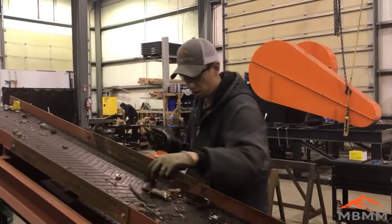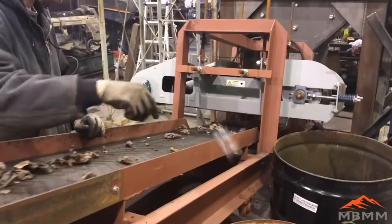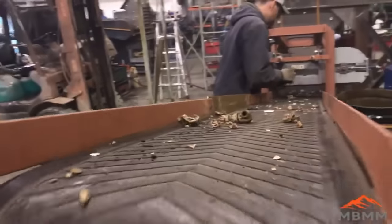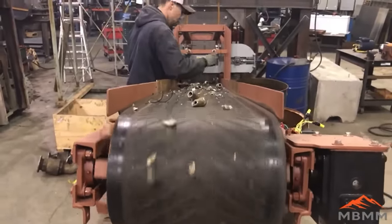So I was the one picking the waste off the belt, and I was doing two things. I was picking off the aluminum, the stainless, anything that was not clean brass. As well as copper and anything of higher value, I was throwing in a different bin. So not only was I getting the waste out of the stream, but I was also upgrading as well.